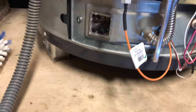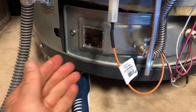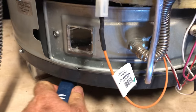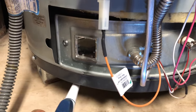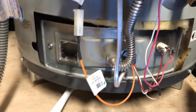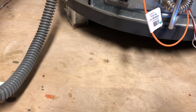So what you need to do, again with the water heater off, is get a brush like this. You need to stick it under here and kind of feel around. Push or pull up on the brush and just scrape around a little bit, try to get back as far as you can. Scrape back and forth, front and back, trying to clean up that area. When you're done, try to scrape out some of that dust and debris, and then come back with a vacuum and clean that up.